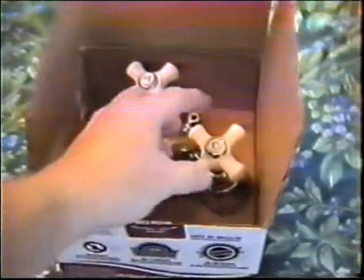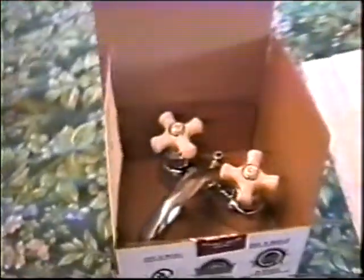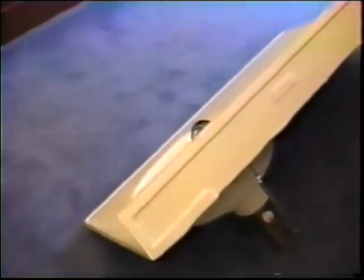Look at those nice matching antique faucets. Probably made of carbon fiber. We haven't picked out the wallpaper yet, but we spent the whole night looking at wallpaper — I could have built a plane in that time. Faucet next. One of the tricks I learned, and it's a real good trick if you're doing your own bathroom: put the faucets and drain and everything in before you put the countertop in. Then you don't have to crawl on your knees to do it. I'm not so good at crawling at my age. That's the best tip I've ever seen in my life — get all the faucets in before you even drop the countertop.